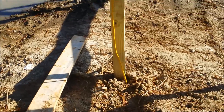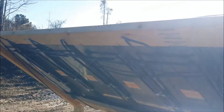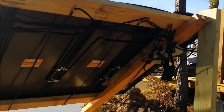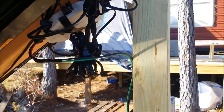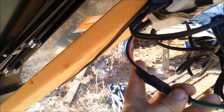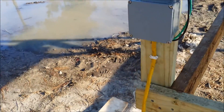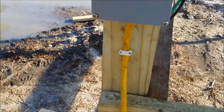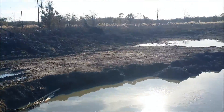Let me go around back here and I'll show you how this system is wired up. Each one of these panels has a basic connector that comes off the back with 2 wires. Harbor Freight sells a Thunderbolt brand solar connector hub where you can connect 8 of these panels together — it handles 400 watts. On the output I spliced in some 10-gauge stranded wire that runs into a little transfer box I built. From there I use 10-gauge heavy-duty outdoor extension cords, and then conduit that's going to be buried running into the cabin.